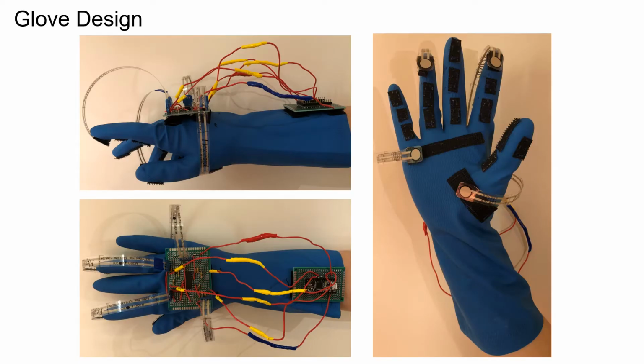We designed the glove using FlexiForce A201 sensors, which are force-sensitive resistors. These sensors act as variable resistors which linearly increase in conductance as force is applied. They are integrated into a non-inverting op-amp circuit to improve the linearity of the force versus conductance relationship and are connected to an Adafruit Itsy Bitsy microcontroller to collect the data. In order to determine the specific linear relationship between conductance and force for each sensor, they must be calibrated using a force gauge and the force values related to a conductance value. This calibration process generates a linear equation that can be used to read force directly off of each sensor.